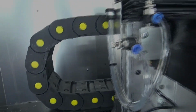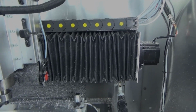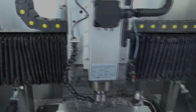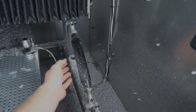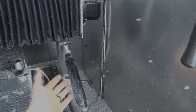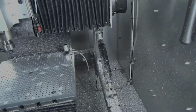You can see the main towers bolt here, two big 5/8 bolts. That was all machined. The pad on this bar and the bottom of this was machined. And then that is attached to a big piece of tube with a big piece of plate welded to the tube, and the towers bolt to these big pieces of steel here from the side, and also from the front under the bellows here. These, my original intent is for these to be triangulating pieces. I'm now bringing the support up to this height instead of just supported down here. It's much more structurally sound and rigid, and also was used to tram the machine, and it worked just as I hoped.